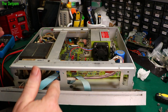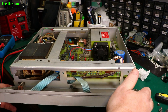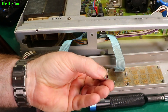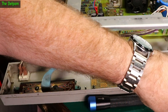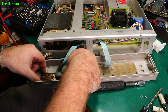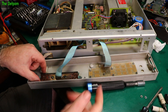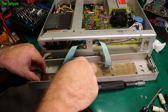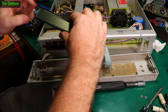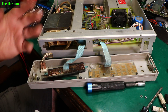What I want to do now is dust around inside here, get things cleaned up a bit, and move the display. Clean all the face up on that display and I'll drill these holes out — easy enough. This thing uses little cheap plastic nut things, which are weird like depressed nuts. You have to be really careful getting them off because these posts are obviously going to be fragile being this age, so just up and down to free it up, get any swarf out, because as it's undoing it's actually cutting more swarf. Going up and down helps keep it clean and stop it from binding up, which means then you can pull the display out. There we go — there's the display. All I really want to do is just give it a clean with some alcohol and get it all nice again.